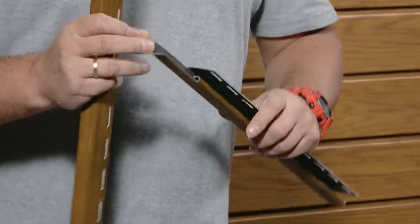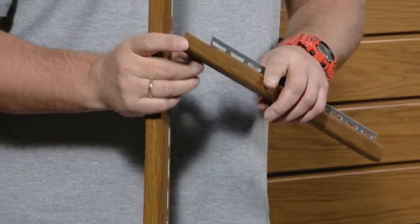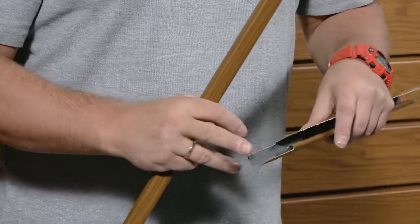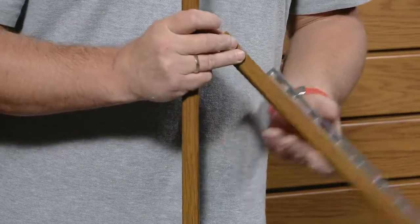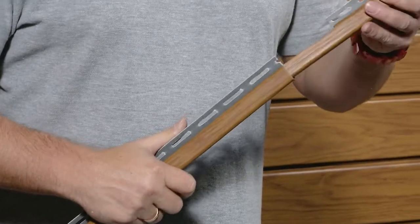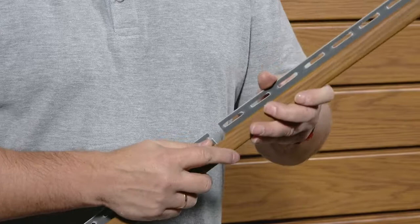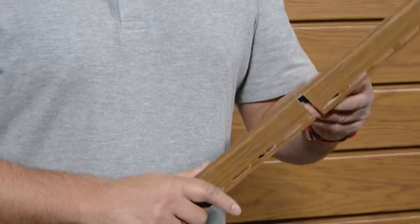In the case of a J-trim slat, the connection can be made very easily. Cut off the unnecessary parts of the slat to make it possible to connect it with an appropriate J-trim profile by sliding it into the slat sleeve here. This way we ensure that the slat can expand over its length.